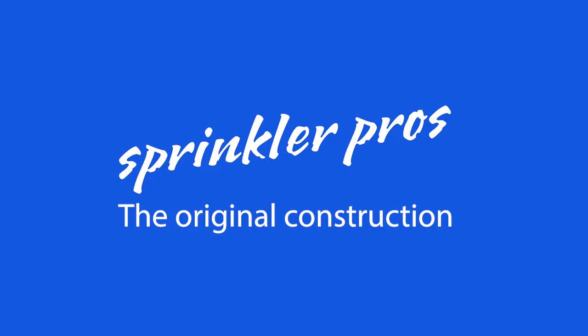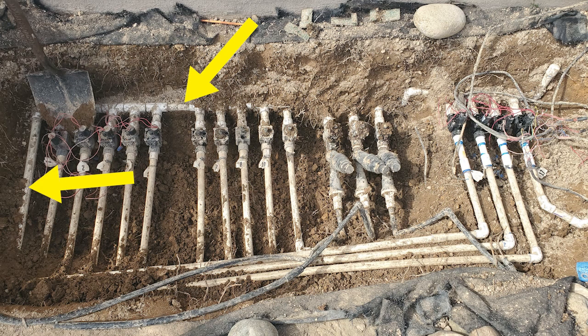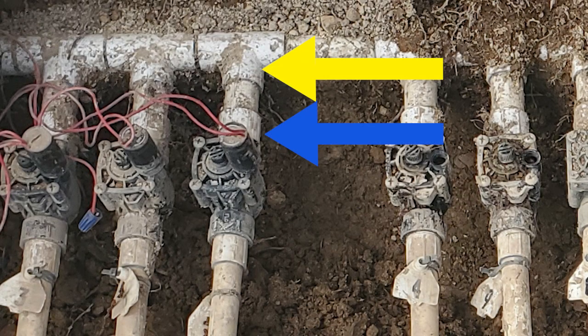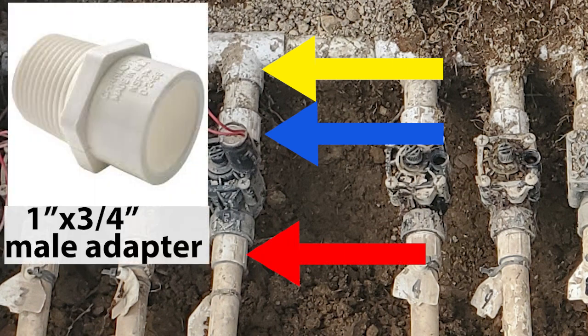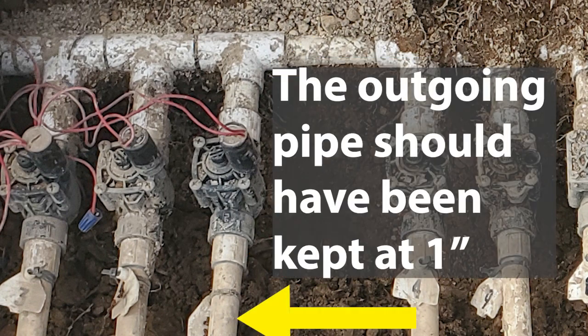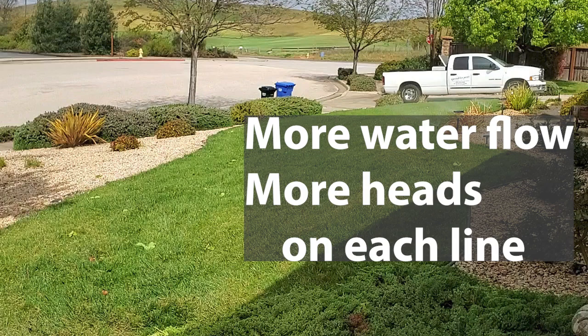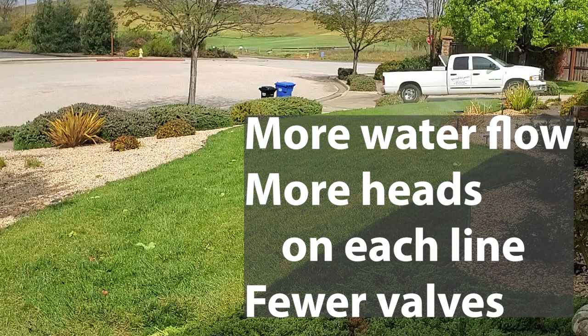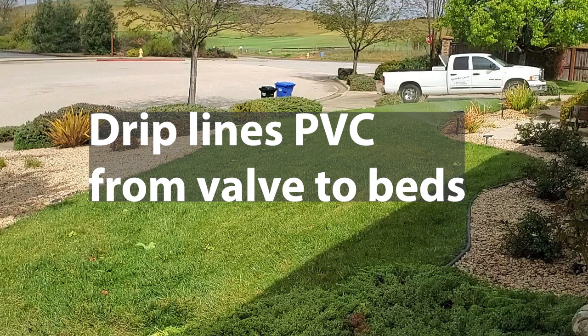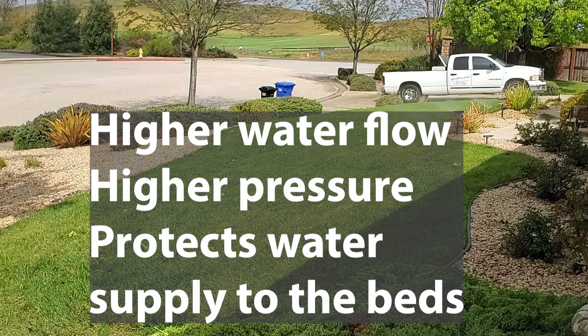A word on the construction of these manifolds. The water supply originates at this one-inch PVB, and the one-inch PVC pipe continues to the back side of each manifold where there are one-inch T's and male adapters leading into the one-inch valves. After the valve it reduces using one-inch by three-quarter-inch male adapters, then three-quarter-inch pipe out to the system — that's poor installation practice. On a property this size, the piping should have been kept at one inch out to the lawns then reduced incrementally. That would have allowed more water flow, more heads on each line, and reduced the number of valves needed. Also, the drip line should have been PVC running from the valve out to the beds — that's where the PVC should have converted to tubing — which keeps water flow rate and pressure higher and protects the water supply to the bed.